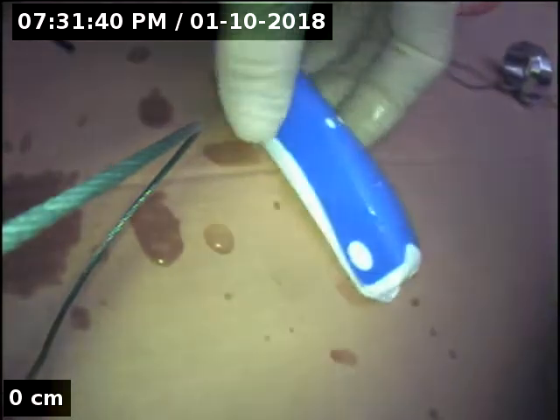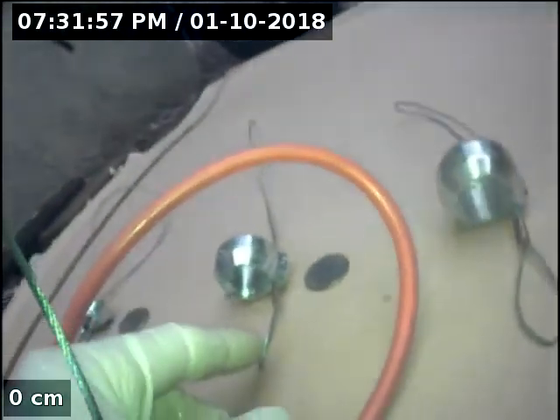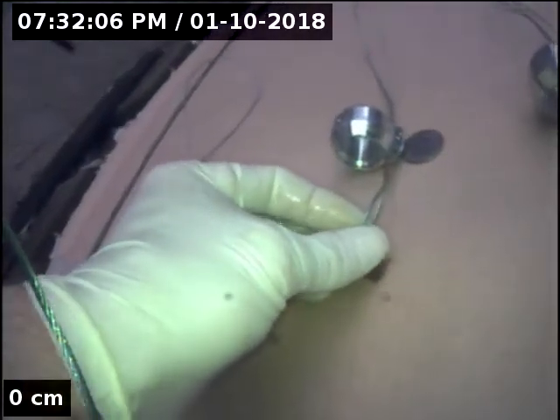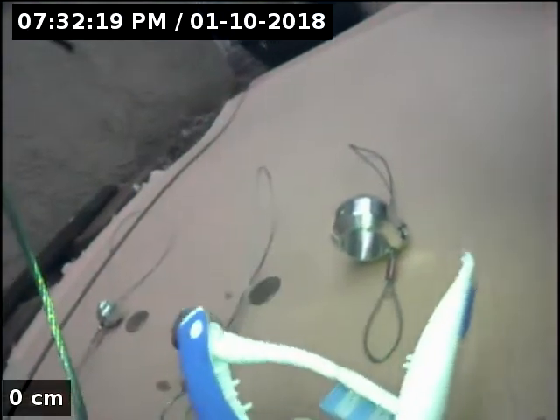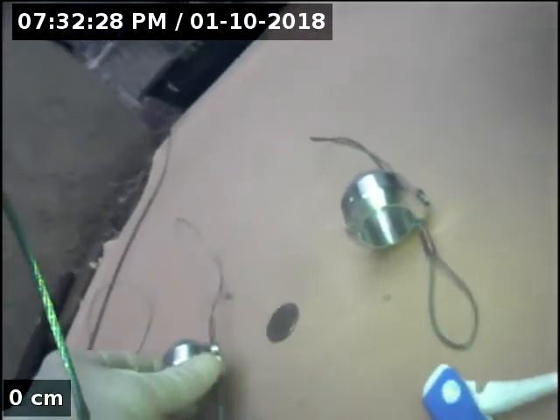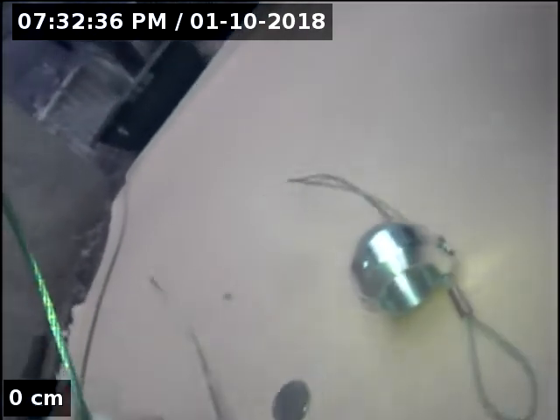We'll pull this off. See, this is a little collapsible Colgate travel toothbrush. So this little snare piece, again, when you pull on the string on the other end, will tighten down and grab the object. Right here, this is the one we just used. We have this regular string — a roll of string — tie it off on the end. Keep it nice and loose so that it pushes through the pipe or the toilet. Then as you pull on this end it tightens up the snare, as you just saw. And in this case, pull out whatever the object is and retrieve it without having to pull the toilet. Or if you're in a regular drain pipe or area drain, you can go ahead and pull the object out, again using three different size custom ones that we've created here.